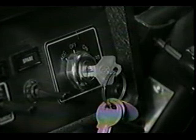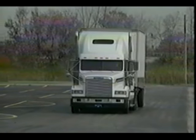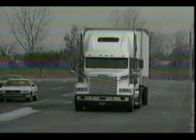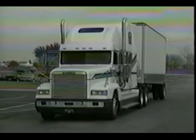Turn the ignition switch on and verify that the ABS warning lamp comes on and goes off. If a wheel speed sensor was replaced, start the vehicle and drive it at a speed above 4 miles per hour. You'll also have to drive the vehicle following any repairs on older Easy Stop systems. The ABS warning lamp should go off. This indicates that the system is operating properly. If it comes back on, then the system still has a fault that must be located and repaired.